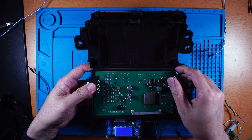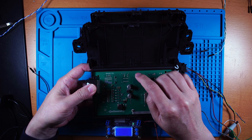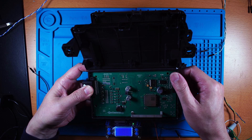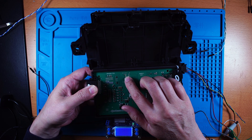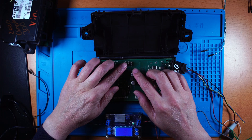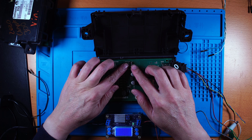On the front side, this is the BDM pinout. It is standard MC9S12 standard pinout and the spacing is also standard. You can solder a pin header like I did on this module. This one is ground, this is the reset pin, and this is the background pin.